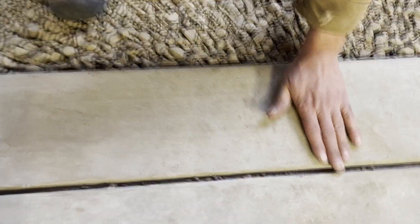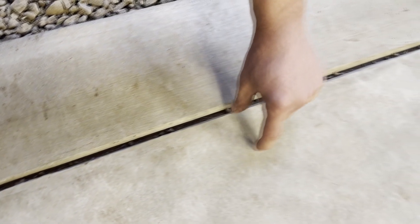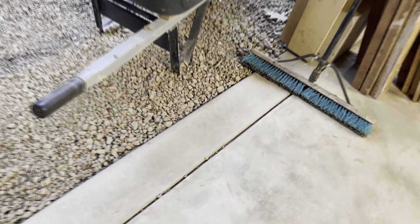You can see here are the other ones we put in during the cut — these lines right here give a nice delineation. This area is actually slightly sloped down so water will kind of pour out that way, because the garage door is going to land right here. It makes a better visual transition from the flat part to the sloped part.